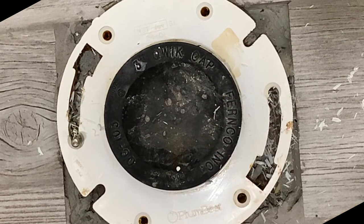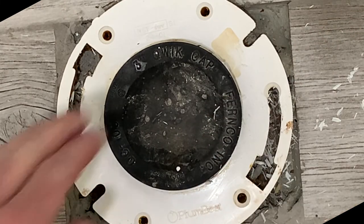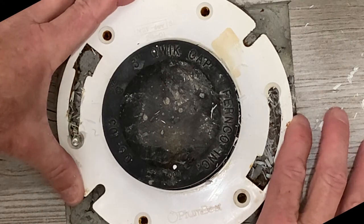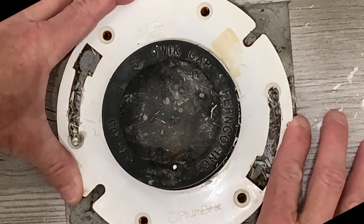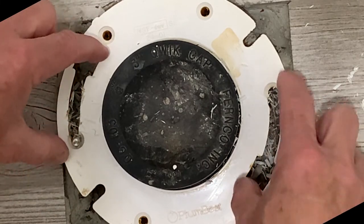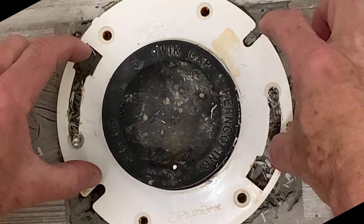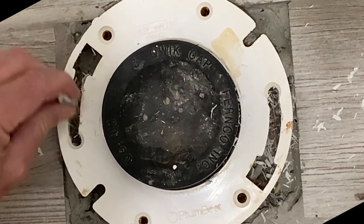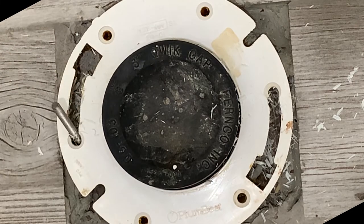I know I'm in good enough shape now — that's all it took to straighten that out. Whenever you're positioning these on the pipe, you need to make sure these two sections are oriented correctly, which gives you a lot of room to put your bolt anywhere in there. It was an easy enough fix and should allow us to put the commode back on straight.